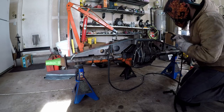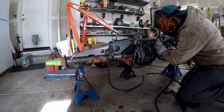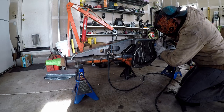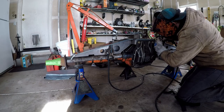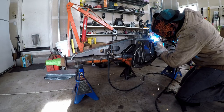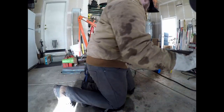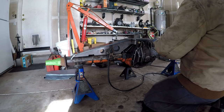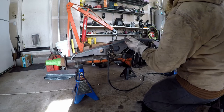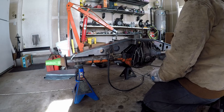I really want this to turn out utterly epic in every way, so I need to just remind myself constantly to take my time, not rush, and always get the ideal settings and the ideal situation for all of this work. That way it just turns out as good as possible. I'm going to do a short stitch across here — that way when it cools later I can do two across here and we'll have a fully welded bit. Even though fully welding across the front would look great, it'll warp like crazy, I'm certain. So I'm going to do like a little two-inch bead here and then move on to a different spot on the truss.